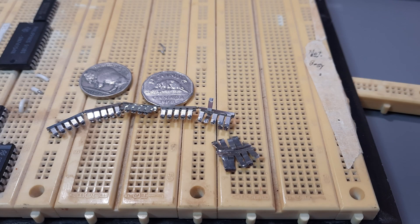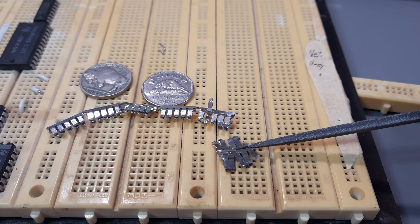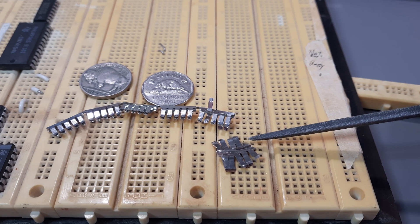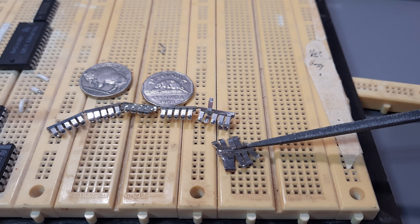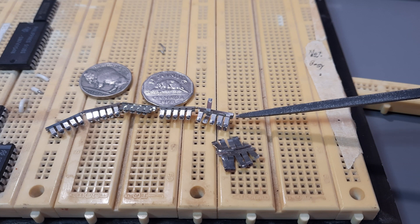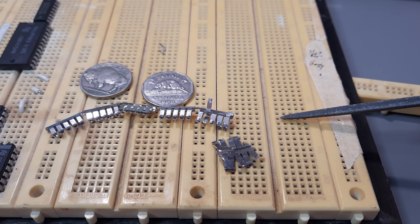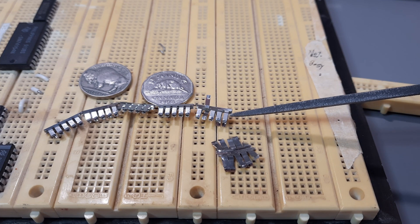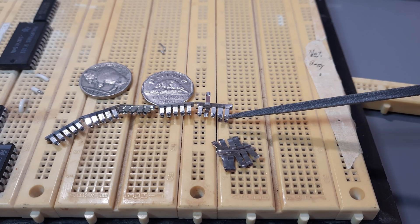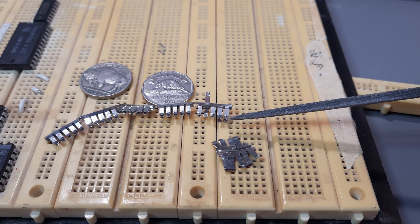In summary, having the contact strip a bit wider increases the springiness so it bounces back. Probably nickel-coated brass — I'm making an assumption on the nickel coating but I think it's a good one. It was a better material than just straight steel. This older one is also a much tighter fit inside, whereas the new cheap one was significantly looser.